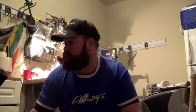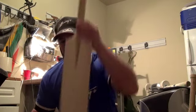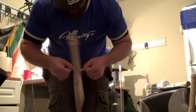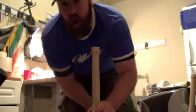The other bits and pieces which you may want to know, the reason why we keep everything kicking around is that old DA discs or old bits of sanding paper you can cut into little strips, so that when you come to do the shoulders, you've got something of which, once in a vise, is a little easier, just to make sure that these top areas, these top surfaces are smooth.